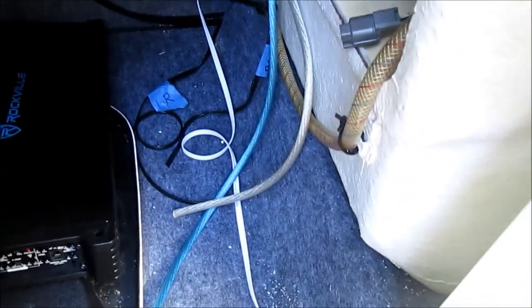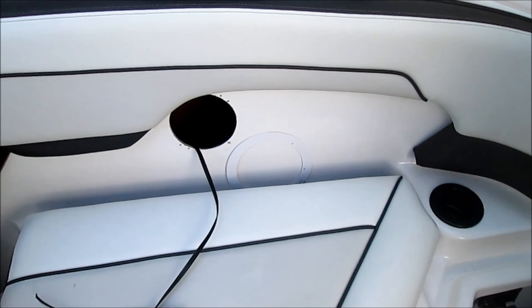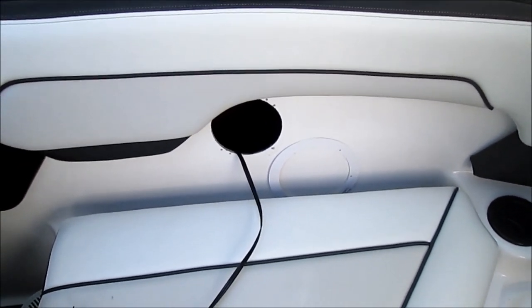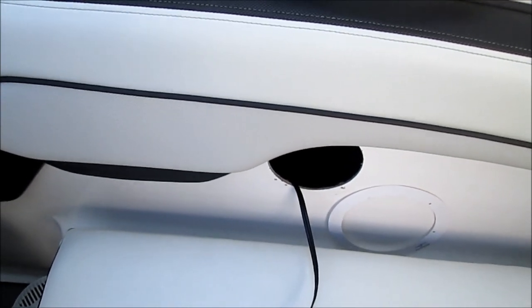Let me show what we've got going on. This is day one and you can see my wires are all run up behind the helm - that's where I'm going to mount the amp. The big wires are my power wires and the other wires are the left, right rear, and subwoofer wire. They all run back through the engine compartment. Now I'm going to zip tie all of these wires up to the wiring harness that runs inside. On the port side there is no wiring harness except for the speaker wire - apparently they ran it all the way around.